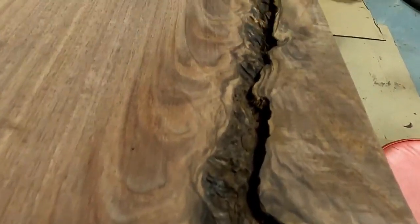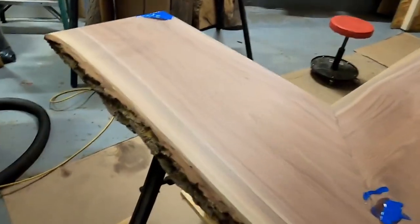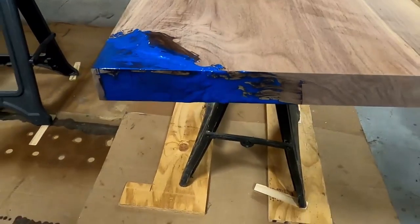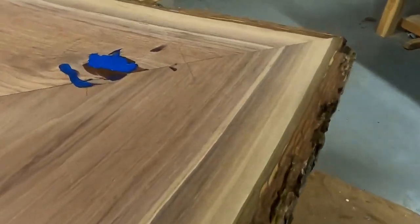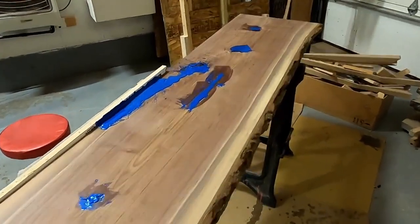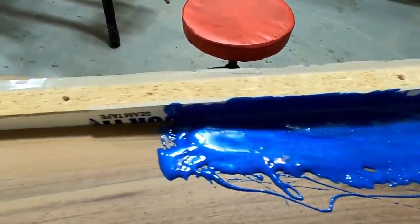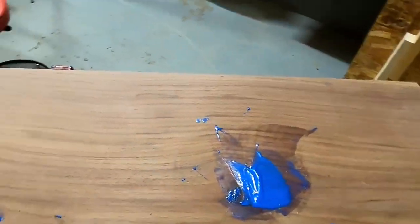We're going to jump ahead to the blue in place and all these voids where I have removed the loose material — that stuff really pops, that ocean blue metallic. As you can see, I overfilled all voids so that we can sand down flush and there won't be any divots or low spots. I tried to keep a lot of the blue out of the crack because we're going to be filling that with a more natural look with sawdust and glue, to fill it in but not make it stand out so much. Along the edge the material is kind of loose to work with, so I used a chunk of MDF with some Tyvek tape to help hold that epoxy in place as it cured.